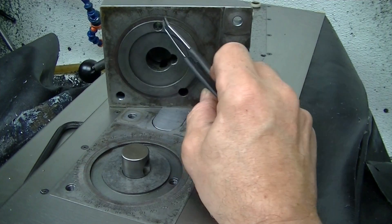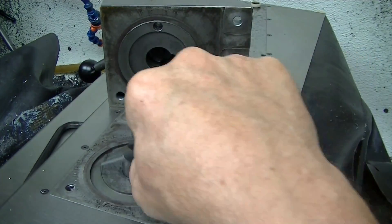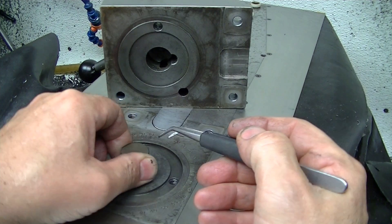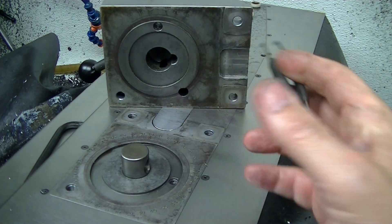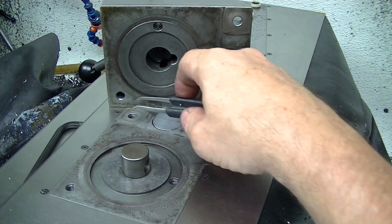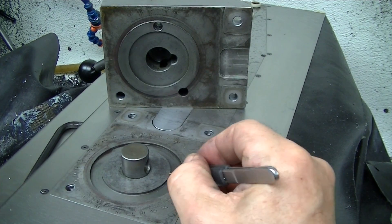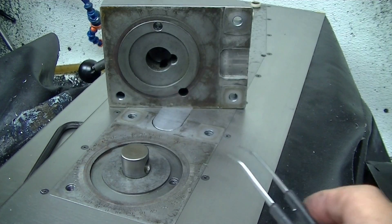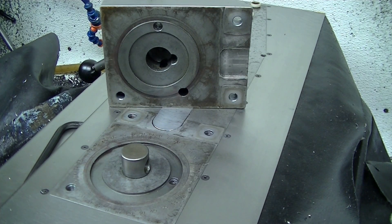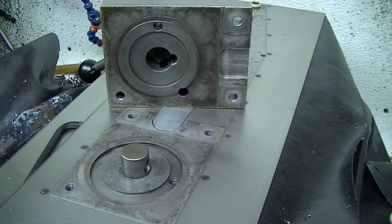Here's what the bottom looks like — milled right into the bottom of the block is the ring that seats in the standard Hardinge compound-style pivot, with clearance for the Woodruff key that goes into the standard Hardinge mount. Because we're gripping down here on the lower surface, these are actually raised feet that had to get scraped. When I put this back on I just use the play in the bolt holes to re-indicate it in — I don't have to mess with the set screws or account for the amount of distortion that's in the block.